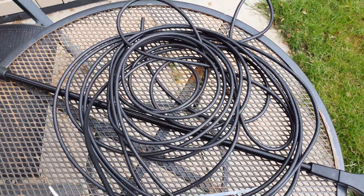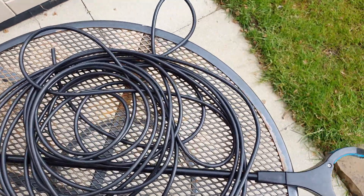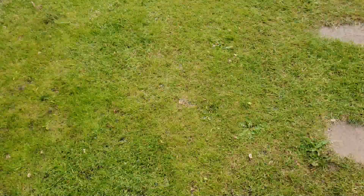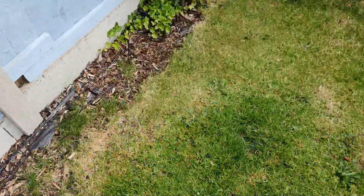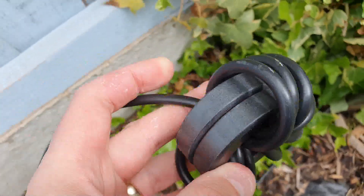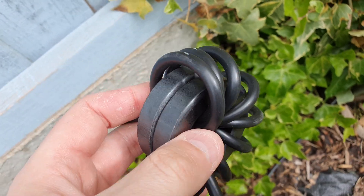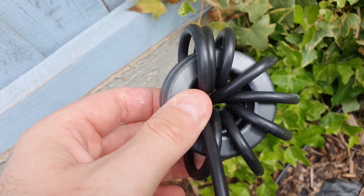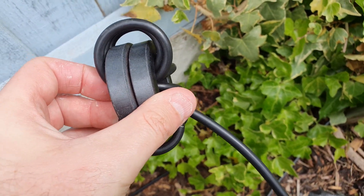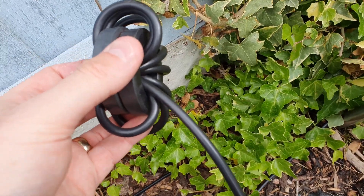I'm going to make a two and a half meter length of patch lead with some plugs on the end. Basically the plan is this is just an inline choke and it's very rough - I just did it loosely. So I'm going to chop that off, put a plug on the end properly, and then use these ferrites to make a choke with a patch lead. I'll have two barrel connectors so it's like an inline choke that I can disconnect if I want.